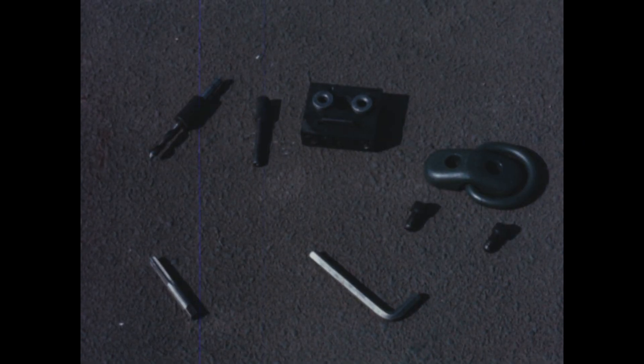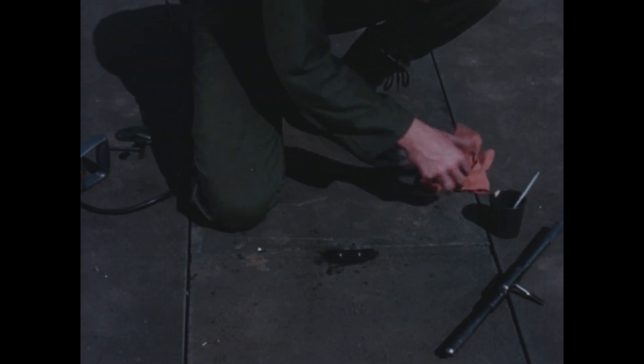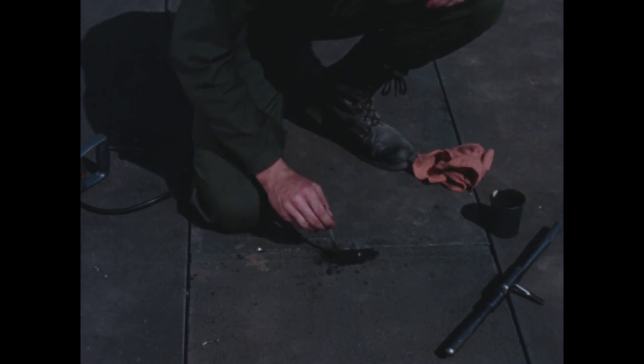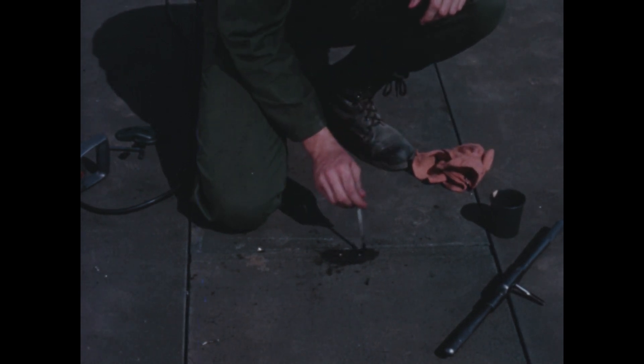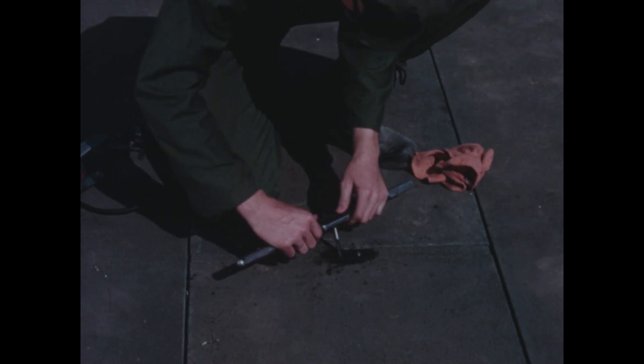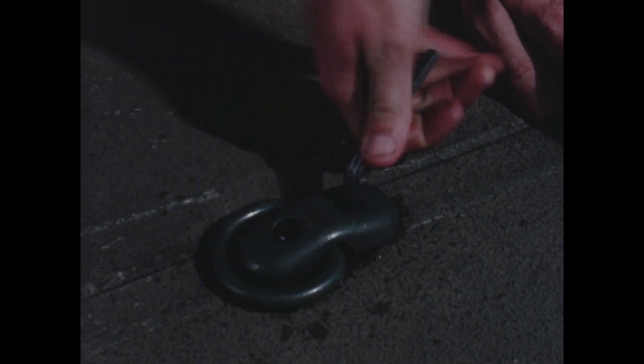Another accessory is a kit for field installation of aircraft tie-downs. The kit includes a jig to ensure proper angle, depth and spacing of holes drilled to accommodate the tie-down. Threads are tapped in the holes with the tool provided and the tie-down fastened securely in place with Allen screws.